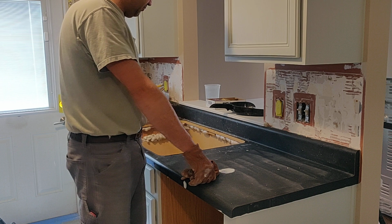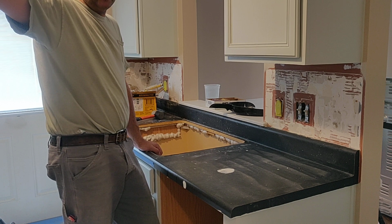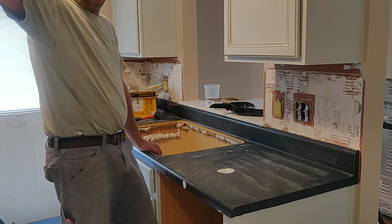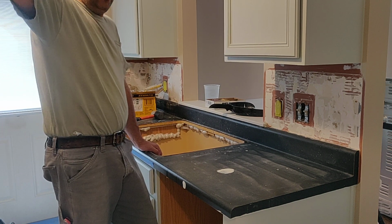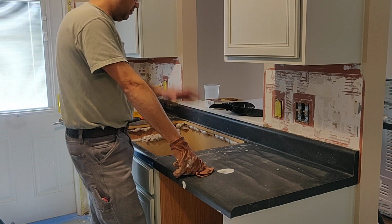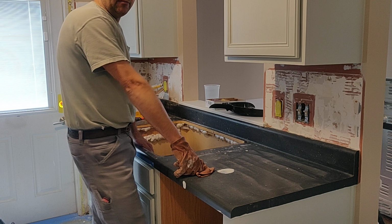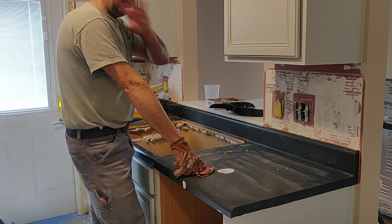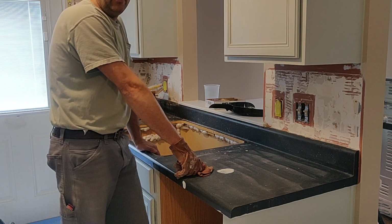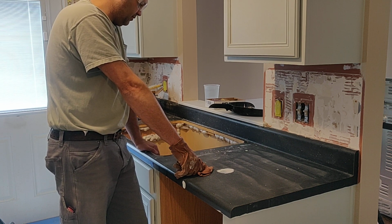So what you want to do is after the water shut off, go out there and turn the water back on. Run a tub upstairs or something, have it open, just in case you need to turn it off quickly. You don't want to leave a lot of pressure on it. You want the pressure to escape into the tub up there, or in another part of the house. So open a valve at a shower or something, turn the water on and check these to see if they're leaking. If they're leaking, turn your water back off, leave that tub running until it runs out of water, and then you're going to have to go get a cap, or get a new shutoff valve, or you won't have water in your house that night. So you need to make sure those shutoff valves aren't leaking.